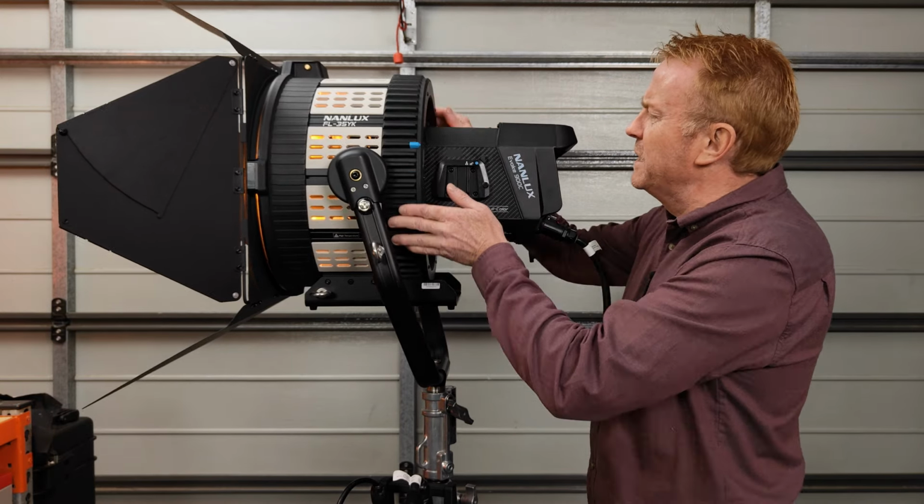And this in combination with the 900C definitely has two distinct rings of light. I would go as far as to say that this is no longer a 26 degree dish. I think it's actually tighter with a fair bit of drop off. On a positive note though, all of the light is merged together from the color emitters and there's no noticeable hue shift towards the edge of the beam.